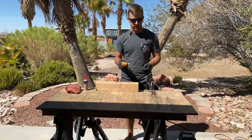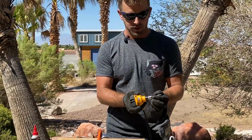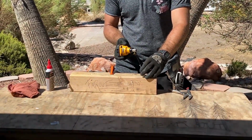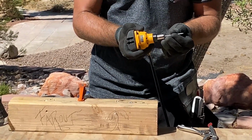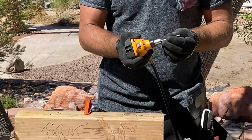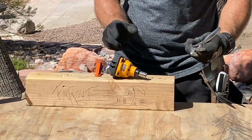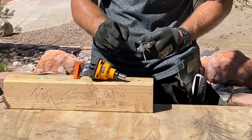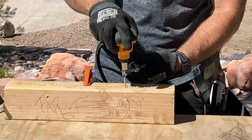A little bit of operational stuff. You can choose to put the nail in the sleeve, though we recommend placing the nail on the surface in which it will be going into. This is much safer. Sometimes if you are placing the nail in and the pin presses down, it catches, it has a tendency to shoot the nail out. Trust me, we've done it. So we choose to either hold it with our hand or use a mini pair of vice grips and hold the nail about mid shaft, place it on the surface, and hammer it down.